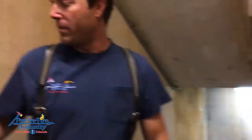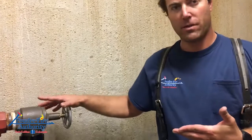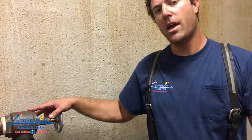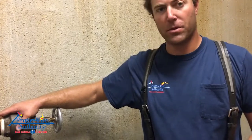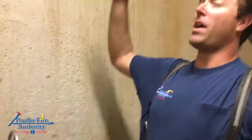Now operating as the forward DO at the standpipe, I've got my pressure gauge hooked up and a 45-degree fitting for a straight shot of hose up the stairwell. Just like you're bringing your fire engine to this standpipe, I'm operating as a DO. What I don't have control over here is increasing pressure with a throttle — everything I control is with this valve. If the fire pump isn't giving me enough pressure, I'll call down to the standpipe DO to increase pressure. I don't know what pressure I've got at this standpipe until I charge this gauge — I might have 5 or 10 floors above me, increasing head pressure. We'll get 100 PSI at either 500 or 250 GPM depending on the standpipe at our furthest discharge, but I'll have additional head pressure on top. I won't know until I open the gauge.